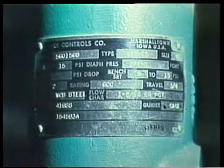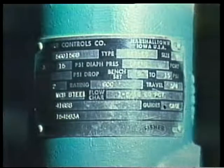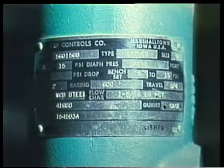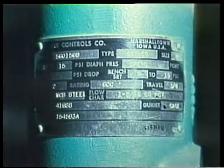While operations personnel are getting your work release, there are a few preliminary jobs you can do. Look at the nameplate on the valve you're going to repair. Copy down the manufacturer, the type and size of the valve, the serial number, and the model number. With this information, you'll be able to get correct technical information and any parts for the valve that you might need. If you're going to work on the valve in place, you can check to see if you need scaffolding, rigging, extra lighting, or other special equipment to do the job. After you've written down the information from the nameplate and gathered the special equipment and your tools, you'll be ready to start when the work release is issued.